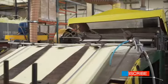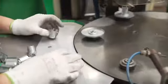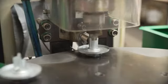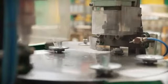The paper is pleated. A cover with a valve for opening oil flow will close the cartridge. In the case of filter clogging, the valve will let oil through in order to avoid engine seizure.